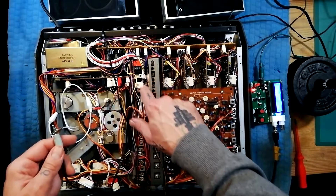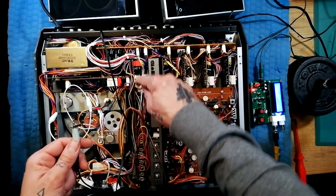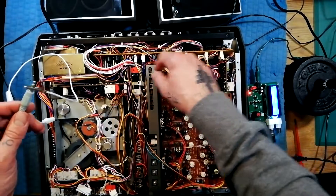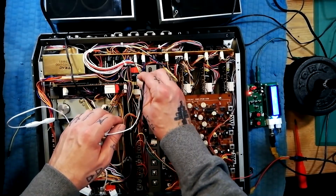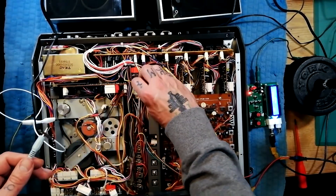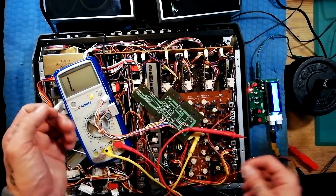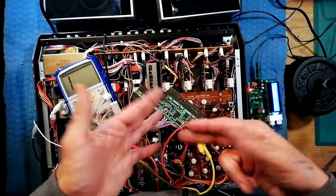So it comes through this cable back to this playback amplifier PCB, which also has the headphone amp on it. Left and right are on the outside and center is ground. Something got dislodged and the headphone monitor switch was set to monitor the auxiliary bus, which doesn't have anything in it — so I wasn't getting a signal. But there we go, it's definitely getting sent to the headphone socket. I could just plug in a pair of headphones and confirm it works. I hope this was of some help to you, and I'll do a video very soon showing how to use a diode tester to establish whether the magnetic heads are okay as well.